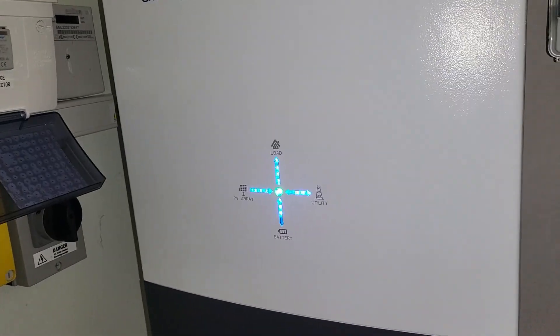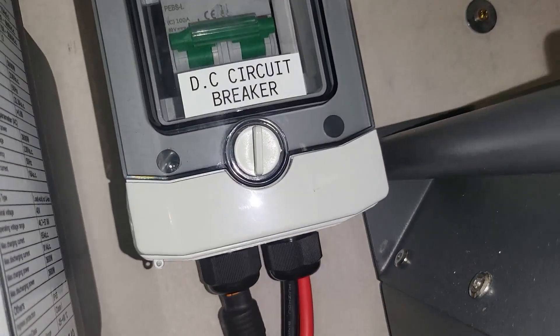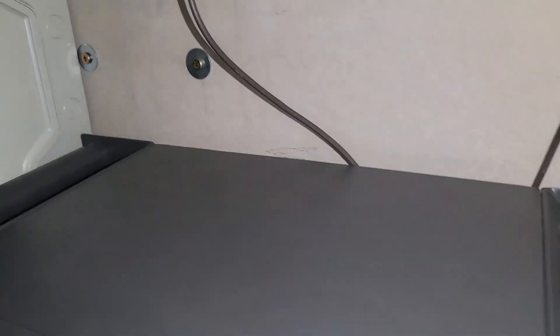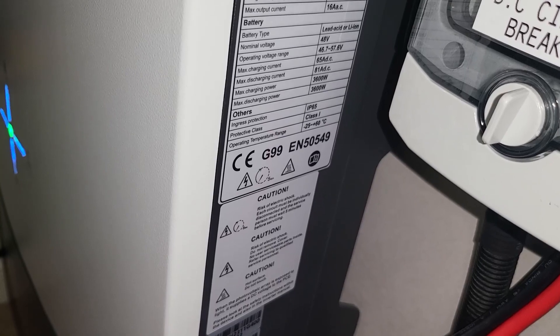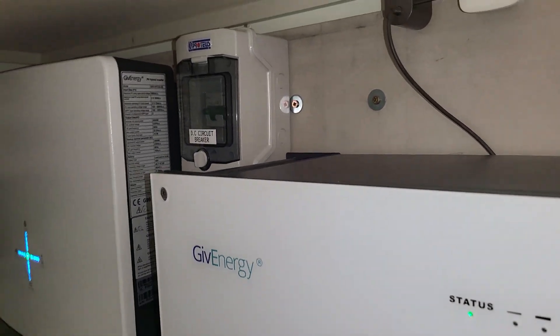Next to the hybrid inverter we've got that MCB which sits in the tails between the hybrid inverter and the battery. The inverter needs to be 300mm off the floor as it is here. You do need to make sure you put an earth bond on the inverter and the battery. We need 300mm top and bottom on that inverter and 250mm between it and the wall and between any equipment. The DC MCB is a little bit close but I figured that was fine in the circumstances — the general principle is there's ventilation around the product. There is a bit of give and take in some of these places where space is limited.